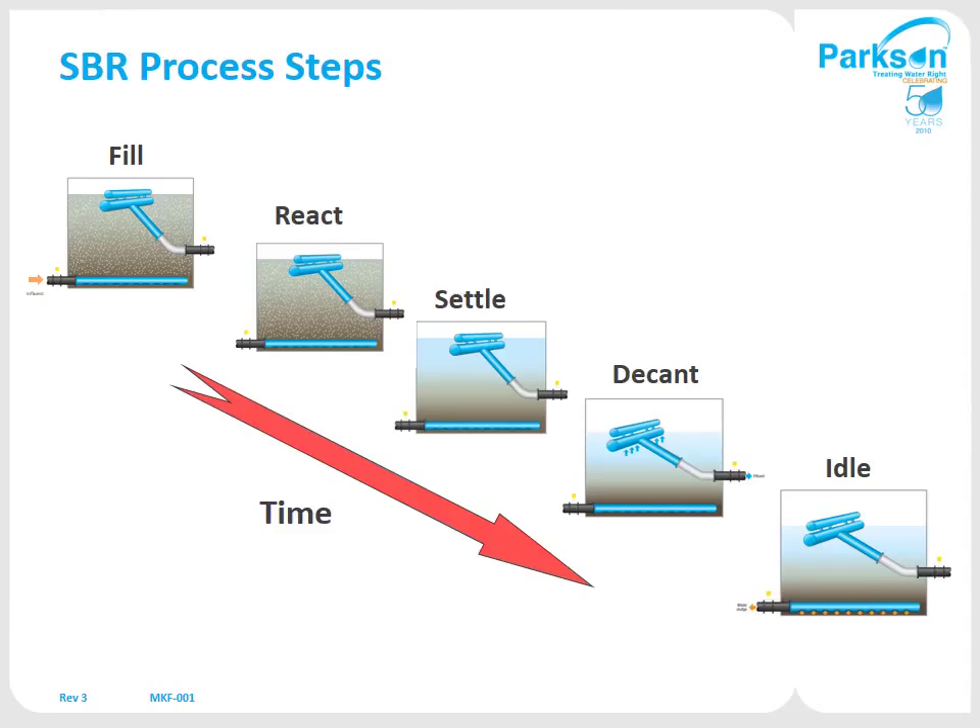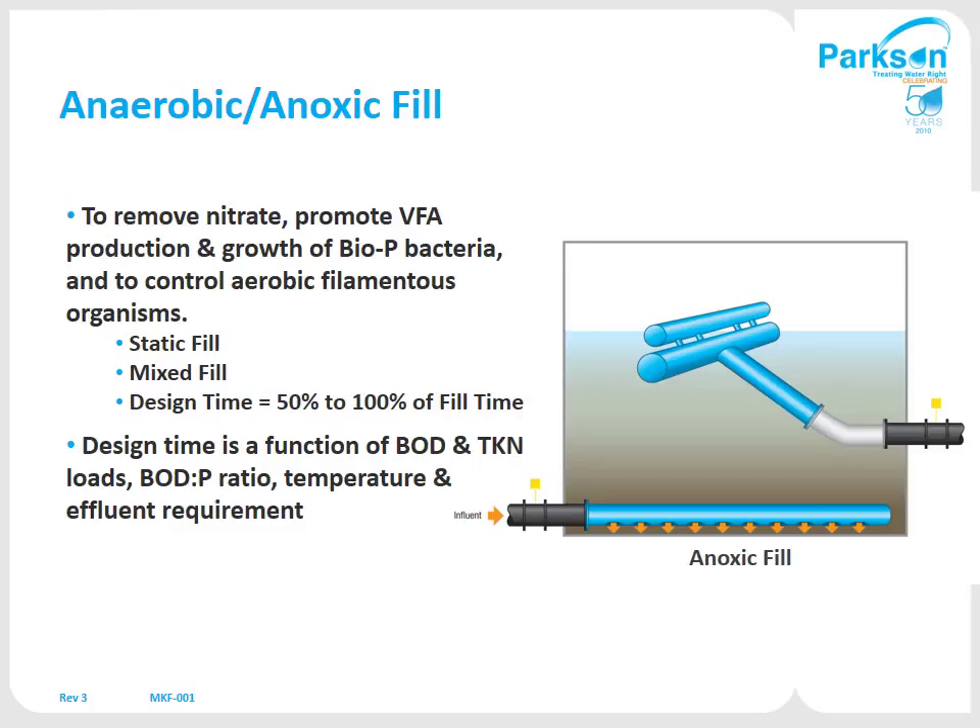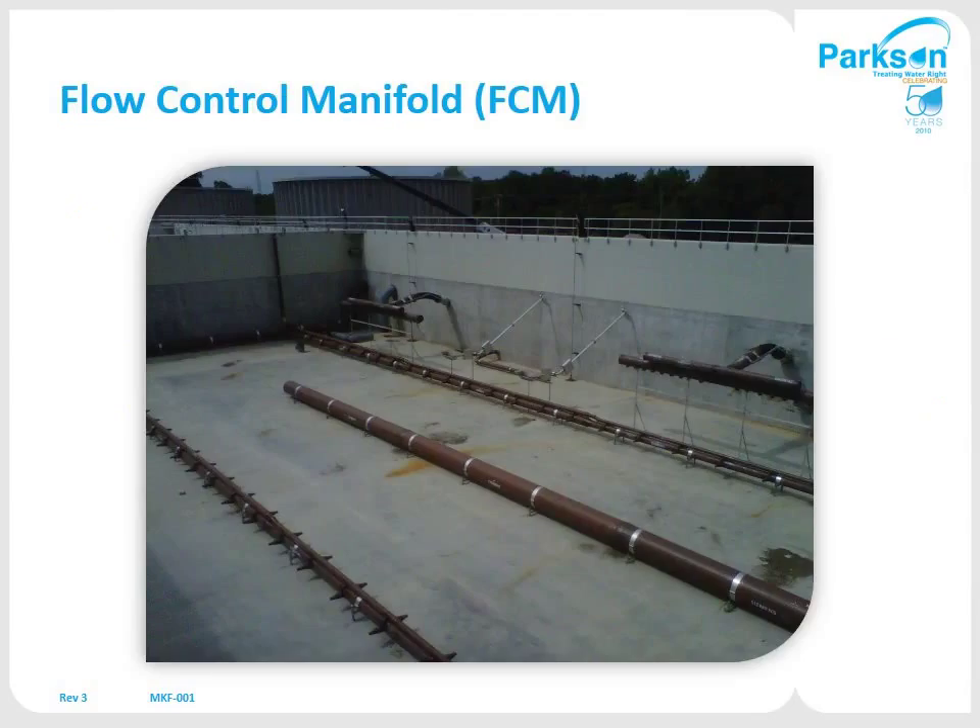Under high flow conditions they could speed up and do more cycles; anything lower will stay at the six-hour cycle and idle time will increase. The first phase is the anaerobic or anoxic fill phase. In this phase you're feeding the sewage into the bottom of the tank. The best-settled biomass is already there, allowing them to get to the soluble BOD while starving off the poor-settling bacteria at the top. There's a pipe across the bottom — the flow control manifold — with big open slots typically three-inch diameter or larger, facing the floor, running almost the full length of the tank at six inches off the floor, allowing the energy to dissipate so that food gets into the bottom without stirring the contents up.